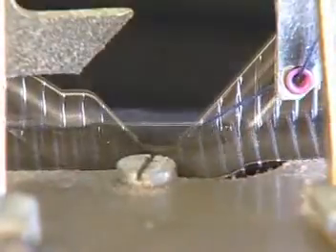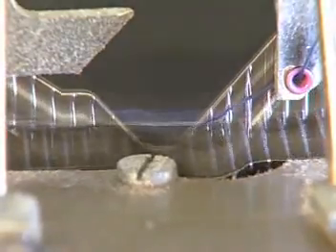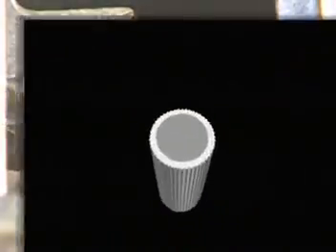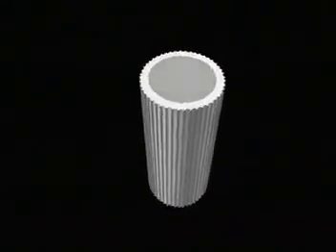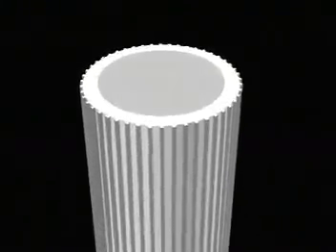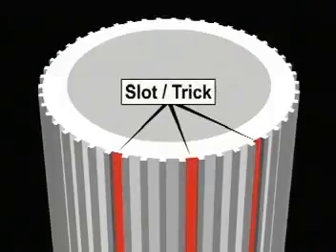In this segment, we describe how needles actually do their work. How are the needles arranged, and what causes them to move? Knitting machines are designed so that each needle can be placed in a groove cut into the outside of a metal cylinder. The cuts or grooves may also be referred to as slots, or tricks.